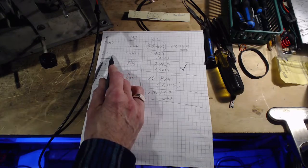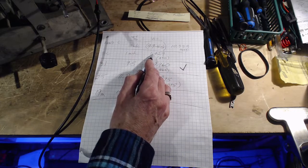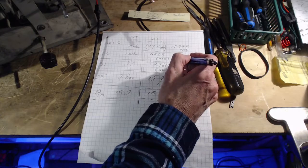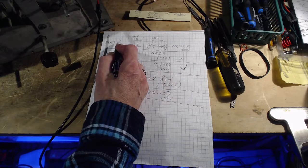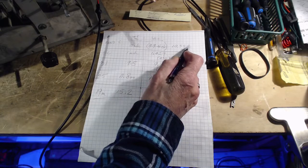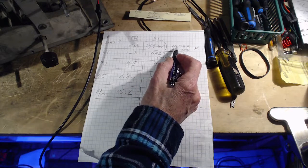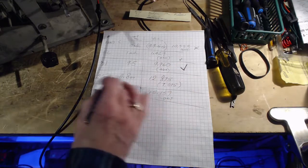Okay, look at the broadcast band. You tune to 1 megahertz. The local oscillator is running at 1.429, 430 kilohertz. Not quite the 455. Put a smaller check mark here though. Band C, when you tune it to 10 megahertz, the local oscillator is at 10.333. I think that's an X. It should be at 10.455. Or maybe it's 460 for this radio.